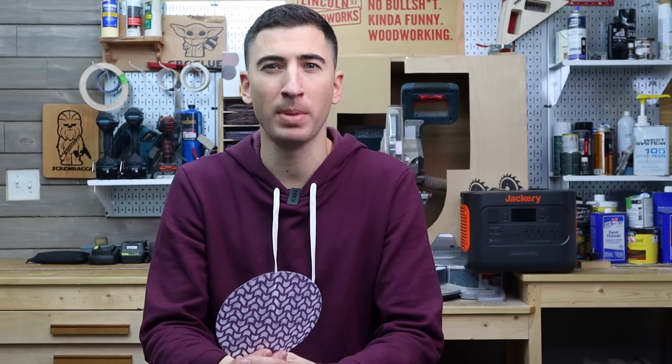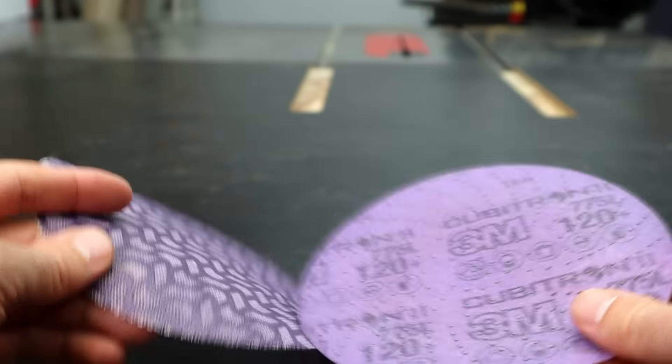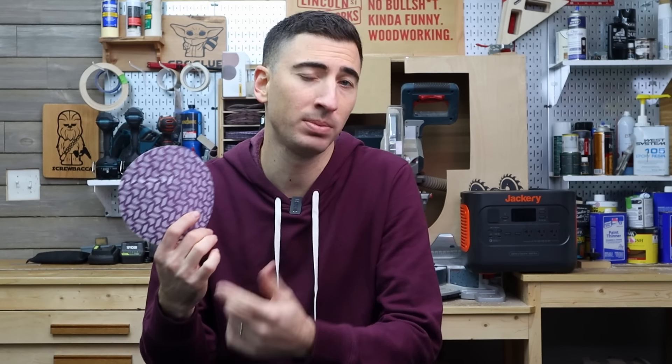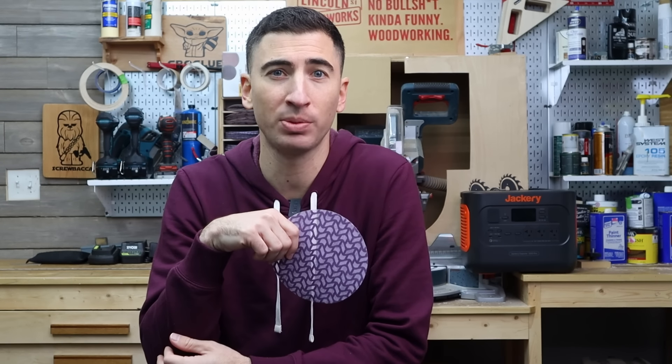So how does the 710W remove the same amount of material as the 775L? The secret is a chevron pattern that lays on top of the round fibers and provides a nice flat area for more tiny tortilla chips to adhere to. More tiny tortilla chips standing straight up and perpendicular to the work surface means faster cutting. And since net-backed discs are cheaper to produce, the 710W is 30% less than the 775L. However, there are downsides. Since more abrasives are stuck on the surface of these net discs, they're more likely to fall off during regular sanding. Anyone who uses the 710W has probably seen little fragments of purple grit left behind. If you don't blow or vacuum that away before moving up to a higher grit, you risk leaving behind scratch marks that will show up when finish is later applied. Net disc edges are much more prone to fraying and eventually tearing, so if you're doing anything other than sanding big flat surfaces, you most likely will not maximize the life of the disc. And because the 775L and 710W are so aggressive, you may need to sand to a higher grit than normal to ensure all of your scratch patterns are actually gone.